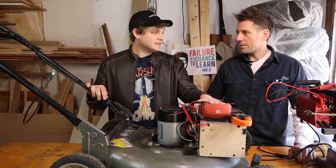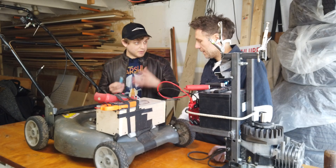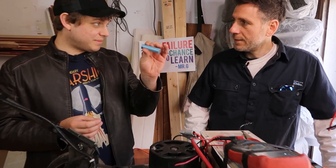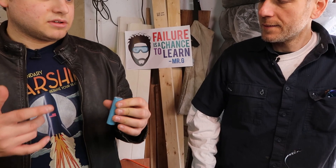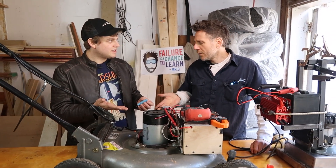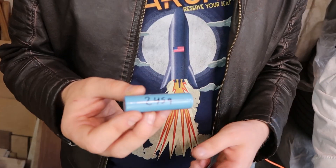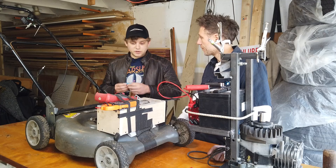You just pick them out and he ships them to you. We broke apart the packs in the modems, got the battery cells, and then put them together in a different configuration. And now we're cutting lawns with it. We actually tested them — we were getting about 2,500 milliamp hours apiece, so we knew these would work.